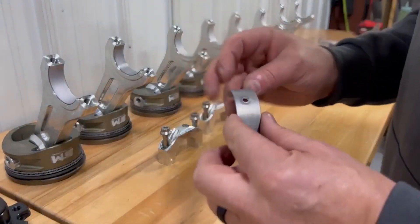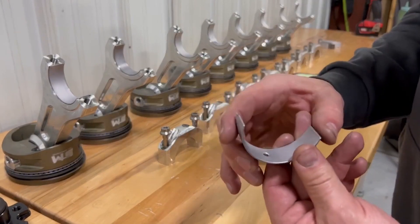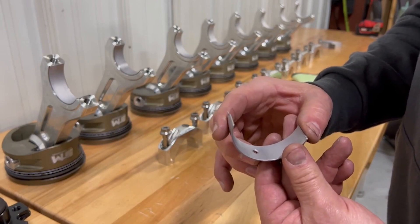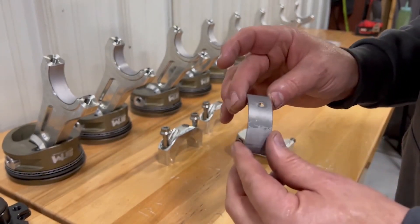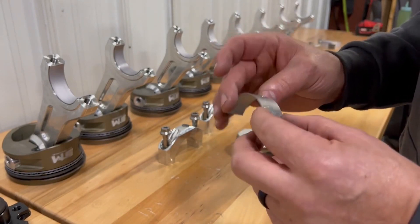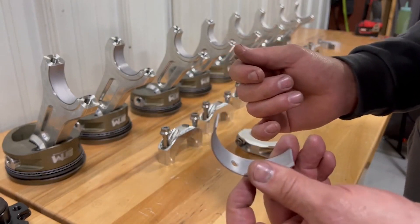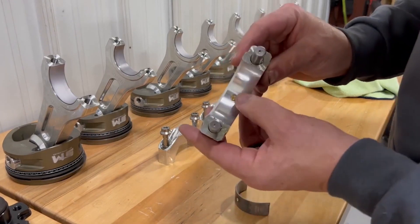Here's an interesting little thing - this is a dowel pin bearing, same dowel and same bearings I've been using forever. All of a sudden, the dowel pin hole has either got a good burr on it or is just slightly undersized, and it is not going onto the dowel pin in the rod.